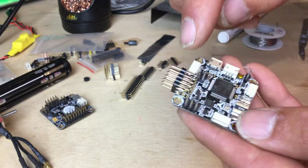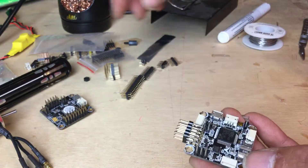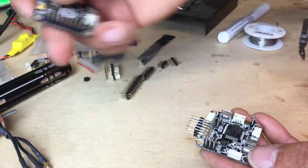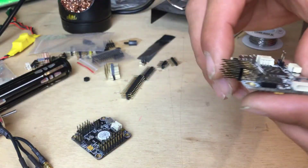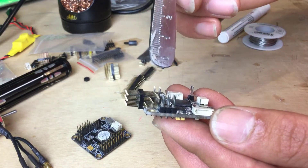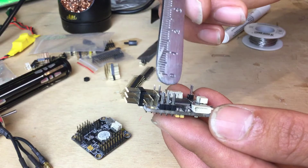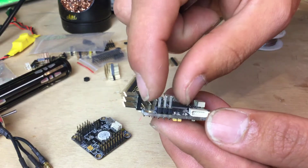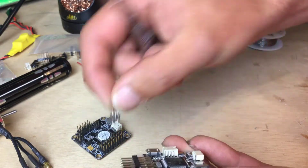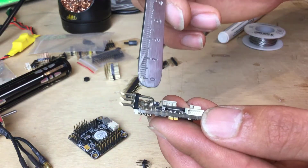A big tip: in my instance, if you're doing a v1 board you'll have all upright pins and that's fine. But in my instance those 90-degree pins are actually lower than the standard upright ones, so I'll take those off and put them to one side first, solder on the shorter ones first, then move to the others.